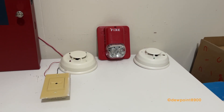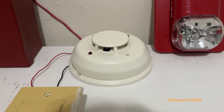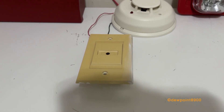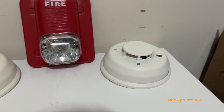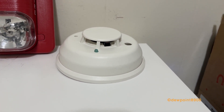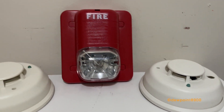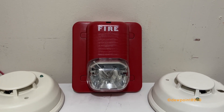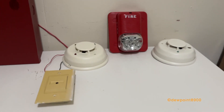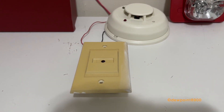The demo system consists of two smoke detectors and a single strobe. Over here is a System Sensor i3 2WTAR-B — a two-wire photoelectric smoke detector with a thermal sensor and a sounder. There's also a System Sensor RA400Z remote LED annunciator connected to it. Over here is another System Sensor i3, a 4WITAR-B four-wire photoelectric smoke detector with an isolated thermal sensor and a sounder. The notification appliance is a System Sensor Spectralert Classic S1224MC strobe. No horns on this system as both detectors have their own sounders. When the two-wire detector alarms, it activates its local sounder and alarms the panel, and also lights the RA400Z LED.